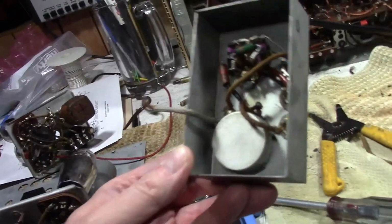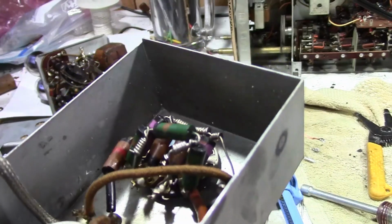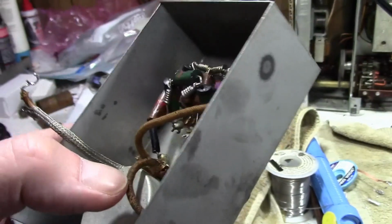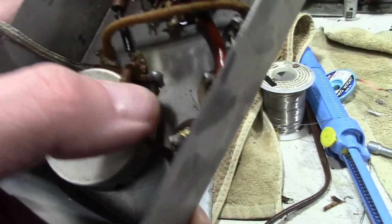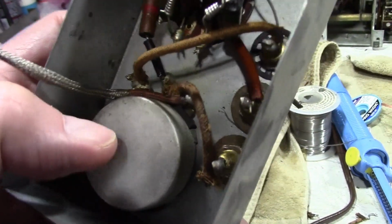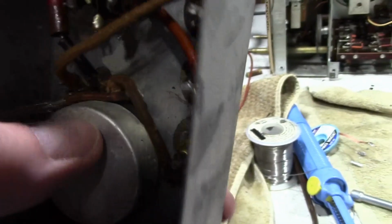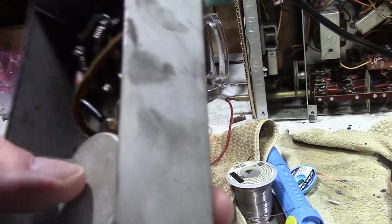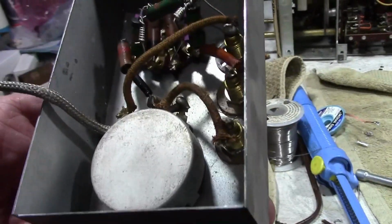The other thing I was going to start working on is this, which is the attenuator. I don't want to mess with that. That is the range switch, but I do want to try to clean the contacts up a little bit. And this is a range, or output level, potentiometer. For some reason, this wire is really frayed. It looked like somebody had really gone back and forth, and it's got some metal fatigue, and some of the strands have broken loose, so it's a little tough to get at. I think I will unmount it by taking that lug off, and I'll also try to get in there with some fader cleaner, potentiometer cleaner basically, but this looks like it's kind of sealed. I could pry up those metal tabs and take the back off to clean it, but without knowing that it's dirty, I don't know that I want to get that involved with doing surgery on it, so I think I'll just leave it be for now.